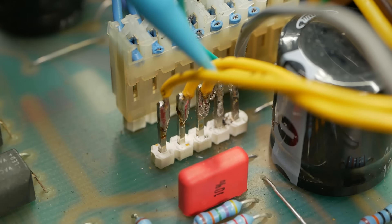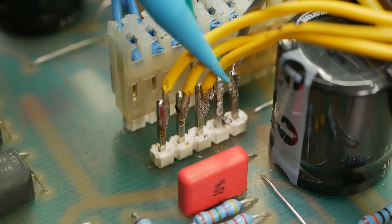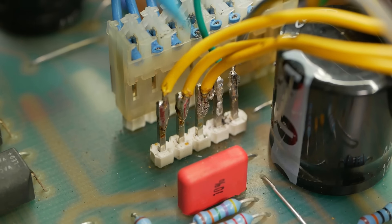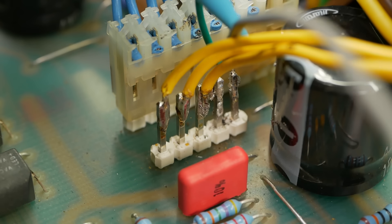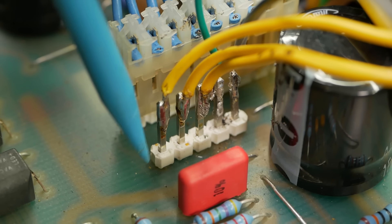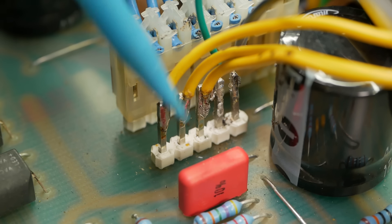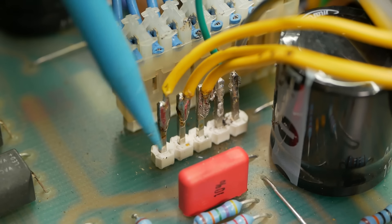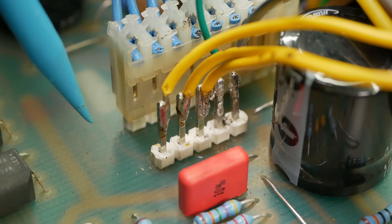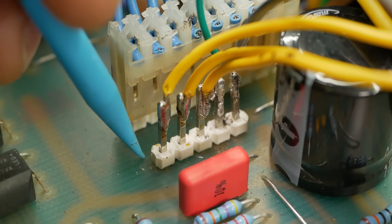You can see this header down here — the leads are marked with dot coding to identify which is which, but everything's just tack soldered to the existing headers. Some of these gaps are less than a millimeter, with stray strands of wire almost touching the next header, and stuff can easily peel off. There's melted insulation in several spots — not a great job. If I'm going to remove a header and solder, I remove the header and solder directly to the circuit board, put the wire through the hole and solder like you normally would — a hardwired connection to the pads on the bottom of the PCB instead of this dodgy stuff. If you bump that, you could create a short circuit or intermittency.